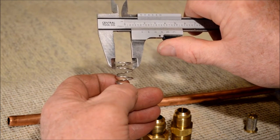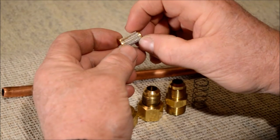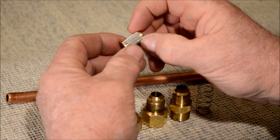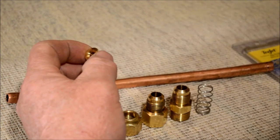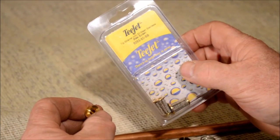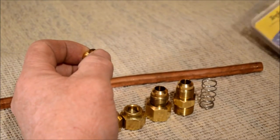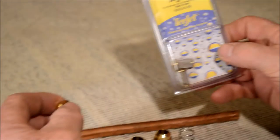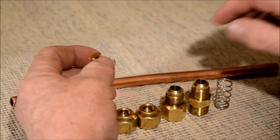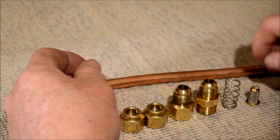The spring can be purchased at the farm store in the spring assortments. You also need a T-Jet screen for a T-Jet sprayer — it's 50 mesh. You can also buy 100 mesh, which is twice as fine. The part number for the T-Jet screen is 5053-50-SS, with SS standing for stainless steel. They come four to a box, approximately $15 a box.